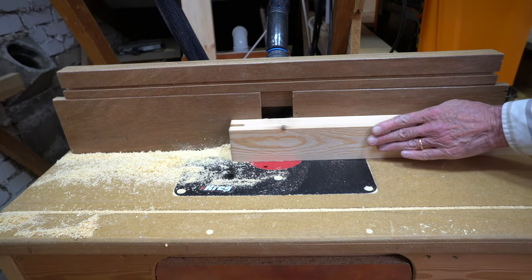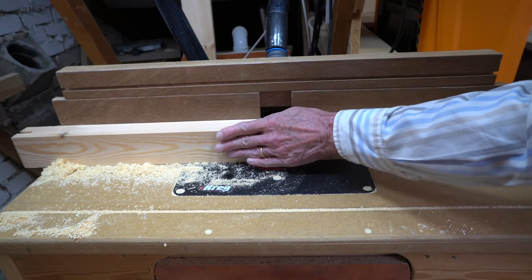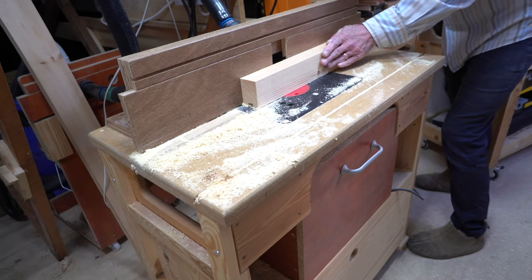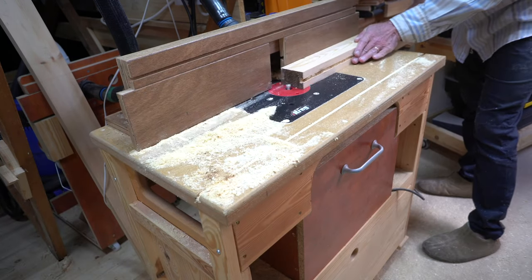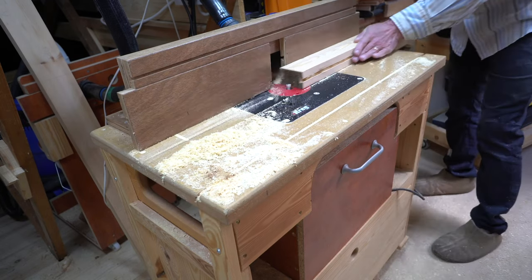I wanted to maximise the clamping opportunities of these seat slash benches. So, using the T-slot cutter I bought to make my jigs with, I routed a stop groove in each face of the four legs.